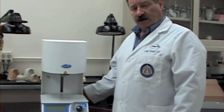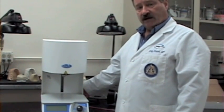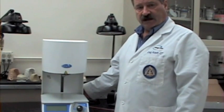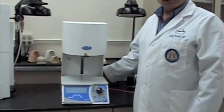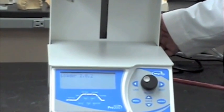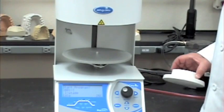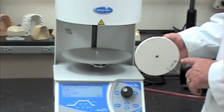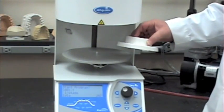It's now safe to turn the power on to your Pro 200 series furnace. Remember that the power switch is located at the back right-hand side of your furnace near the power supply connection. When you turn on the switch, the furnace will run through a series of self-diagnostics. After those self-diagnostics are done, the firing table will lower and you can remove the green paper that is attached. Now with the lift table down, it's time to place the firing tray on the lift table — center the firing tray with the hole over the pin in the lift table.